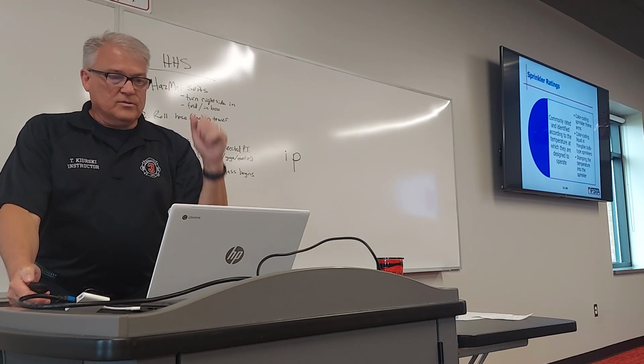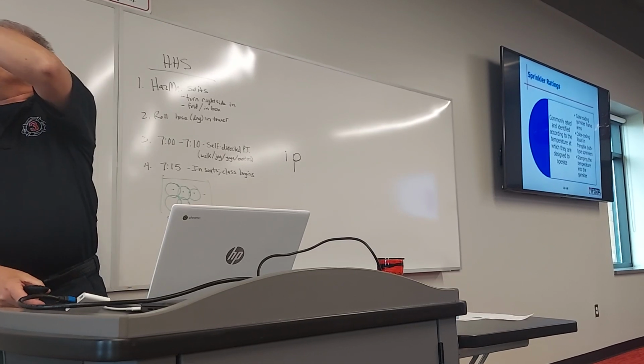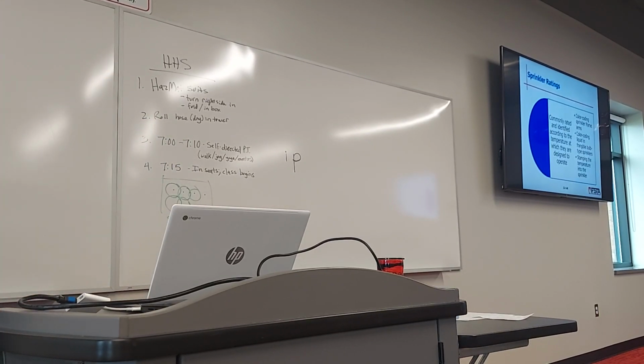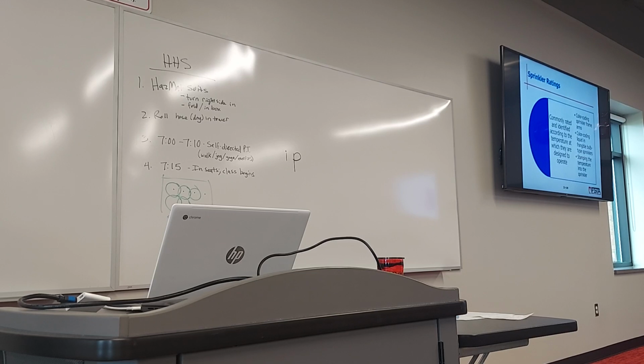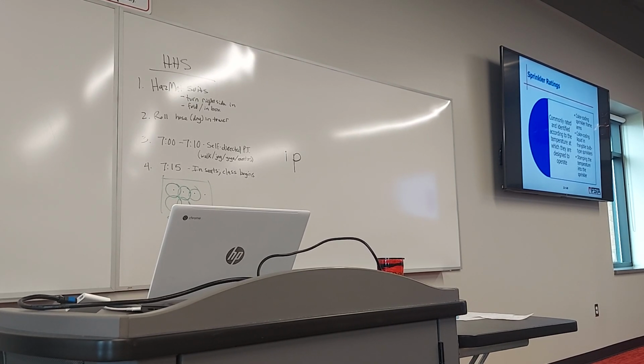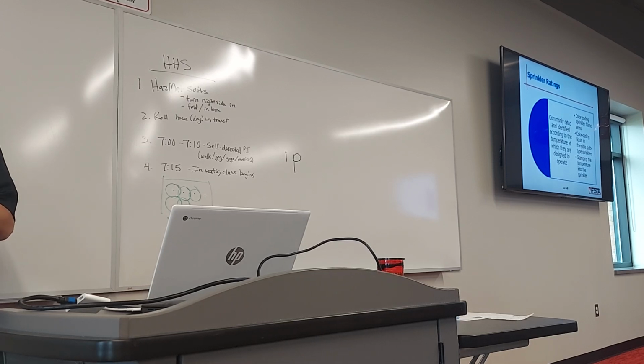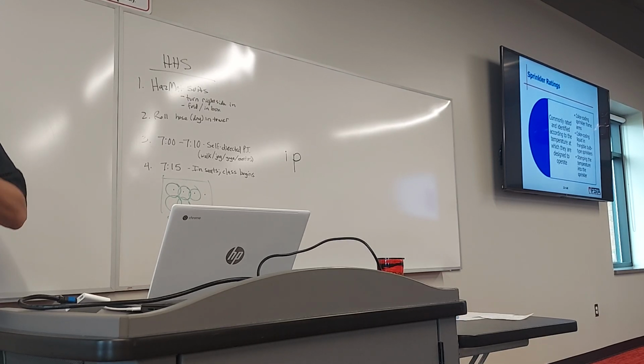Sprinklers are rated according to the temperature at which they're designed to operate. We can color code, so there's a liquid in these. Yeah, see that little vial in there? That's got a red colored liquid in it. The red tells us approximate temperature that it's going to go off at. Okay, but it's rated for a standard, so all office-ish type buildings are going to be rated for somewhere in there. But there's a certain number rating where the color, you can either paint the frame arms or you can look at the liquid inside of there. So liquid, what happens when liquid heats up? It expands.